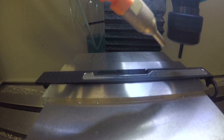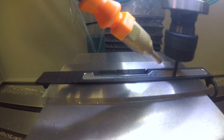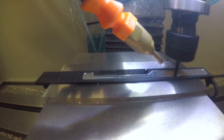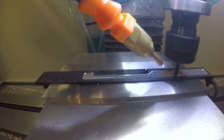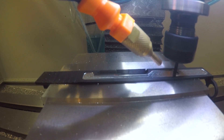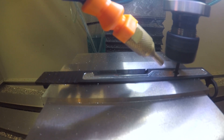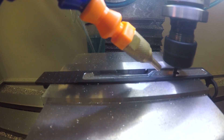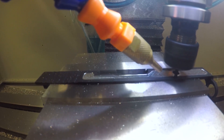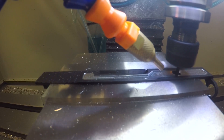Talking about time savings — something I've been doing for the last couple dozen slides is what you're seeing here: a helical ramp all the way to the bottom of that pocket. That helical ramp takes about 2.5 minutes just to reach full depth, and it's a waste of time and good carbide. So in the future I'm going to use a solid carbide drill that's a little bit oversized — over 1/8 of an inch — poke a hole through, then plunge down at full rapid speed at 160 inches a minute to the bottom, and then start the 2D adaptive. The tool change takes about 45 seconds, so that's a net time savings.